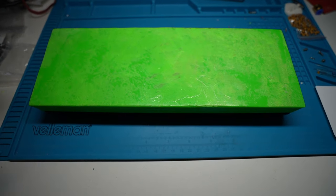This print was done on my open-frame CR-10 and developed a few cracks. I fixed those with a soldering iron and some extra filament as filler. The print does its job, but getting there was not fun. ABS slurry is just nasty to work with and there are better alternatives.